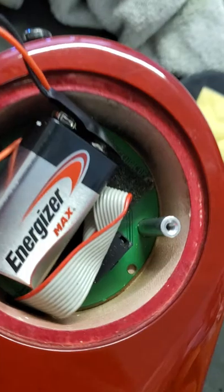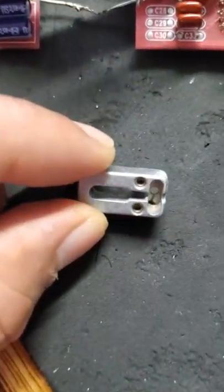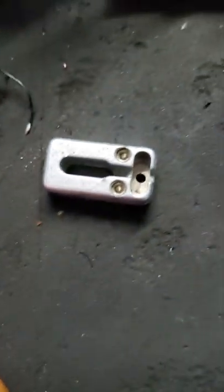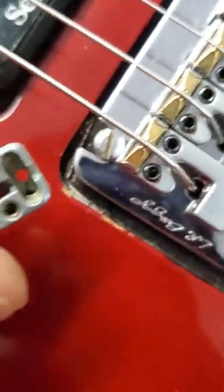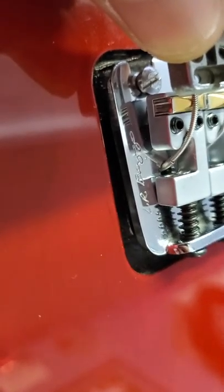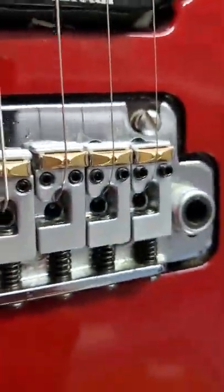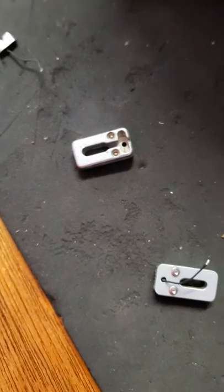There was no spot for a ribbon on the RMC — there's only one ribbon on the RMC coming from the acoustic side, from the acoustic preamp down to the main circuit board. Another thing is the bridge saddle pieces from the LR Baggs wouldn't work either, because the replacement RMC ones are a little wider and wouldn't fit. You can see how that gold stretches through that entire saddle — the new one. So these replacement piezo saddles do not fit in the LR Baggs saddle.